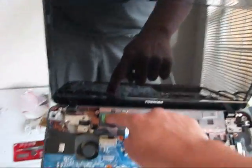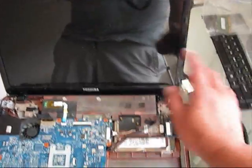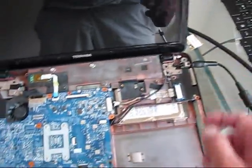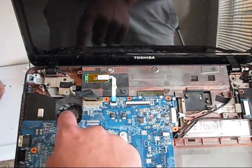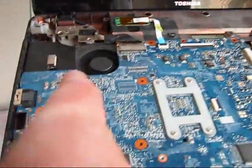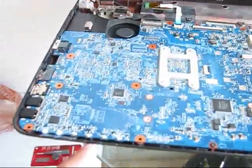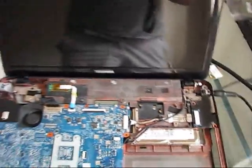As soon as I power it off by holding the power button, I tried the trick that was suggested: disconnect the battery, remove the AC connection, and just power it on. As soon as I power it on, it spins just a little bit — you can see — hard drive started, and then spinning. There is no sign of any HDD activity. The system doesn't boot. I believe it's not a faulty GPU unit, because if you have a faulty GPU, you will have some activity and be able to plug into an external VGA monitor to see the image. But I don't see any activity at all, so I think the CPU I received today is also faulty.